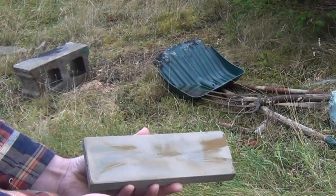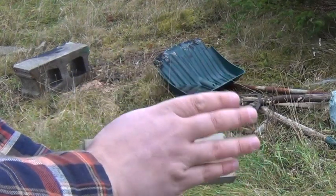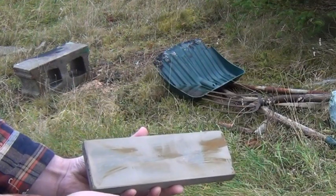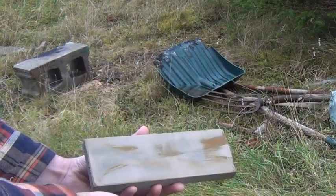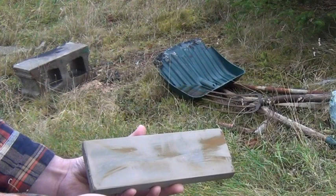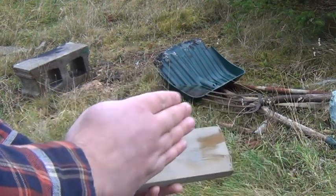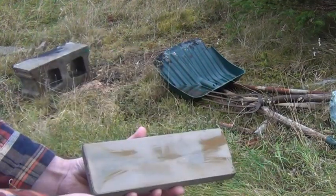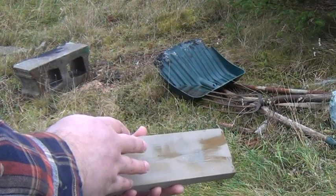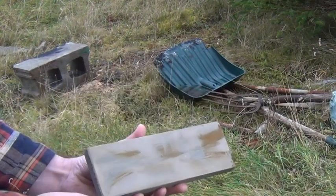So that's one of the reasons why, for me, I flatten the stone after every 5,000 or so passes. If I do that, it keeps the curvature down to at most about one to one-and-a-half degrees increase per side, which I can live with. But if I let it get out of flat — even if I don't flatten it for around 10 or 15,000 passes — way too much hollow. I can end up with easily anywhere between 3 to 5 degrees extra per side, which is way too much variation in edge angle. If I want to sharpen a knife at 10 degrees per side, I want it at 10, not at 15 or 16 with some kind of random edge increment.